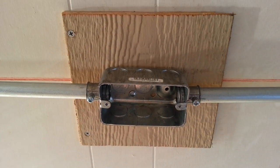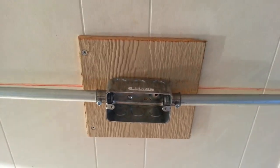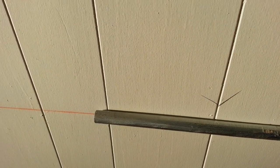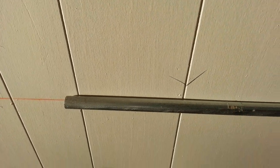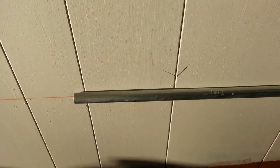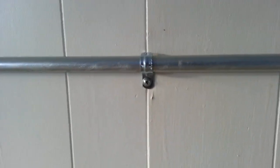You can see how I ended up mounting it — you can see the pad and the mounting screws. I've got the same problem down at this end. I put a temporary screw in just to support it. This time the stud's on the inside, so we're going to screw another pad here and then mount the box out on the end. Don't forget to install your conduit clamps — they'll help with the rigidity quite a bit.